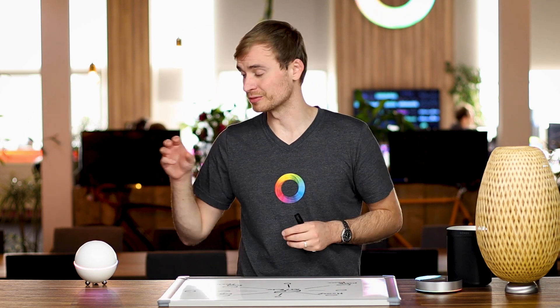A mesh network works a little bit differently. You have a coordinator device — that's often your Homey Pro or Homey Bridge. You have router devices, which are always-powered-on devices. And then you have end devices or end nodes. The coordinator can send and receive signals to router devices, and those router devices can send and receive signals to each other and to other end devices. So it's a lot easier to improve stability, range, and build on that network by adding in more router devices — you're creating a mesh.